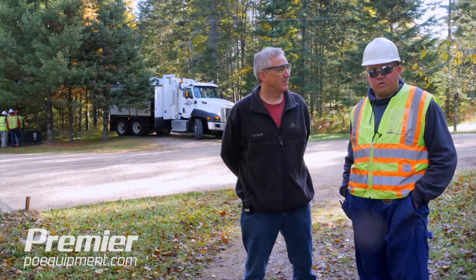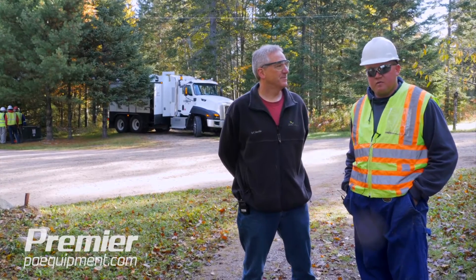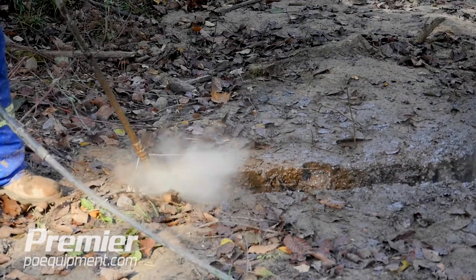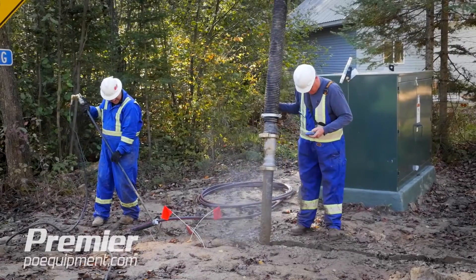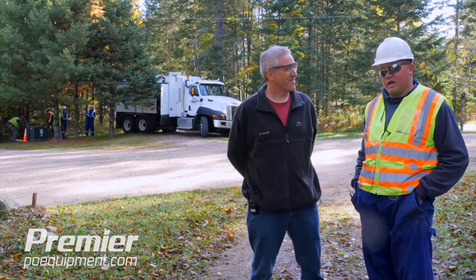Let's go back to the build — I heard some stories. You didn't know what to expect, maybe not as much power as a hydro excavator. We started by borrowing a big air compressor from a local rental shop so we could dig with just air and see what the results were. It was very favorable — it worked well in looser soils. We'd use the water like our big hydrovacs and that did really well too. But then we took water and air and combined them together in a single lance, and the results were just amazing — a three to four times increase in productivity with the combination of air and water together. That was a big surprise. That's opened a lot of eyes.